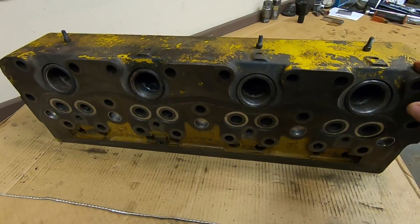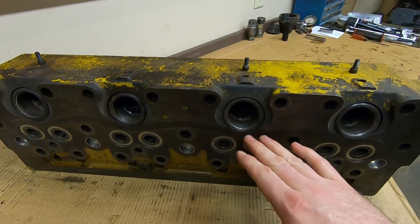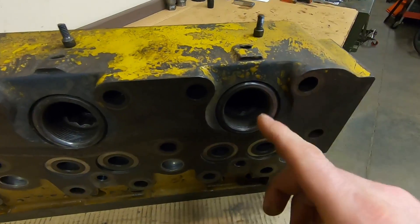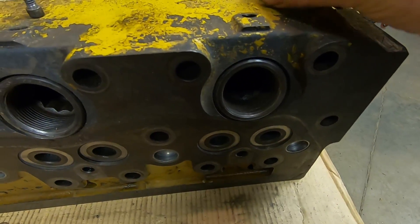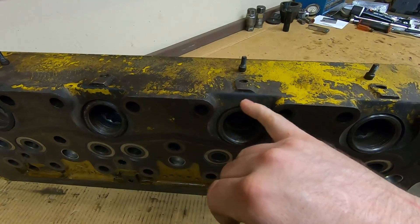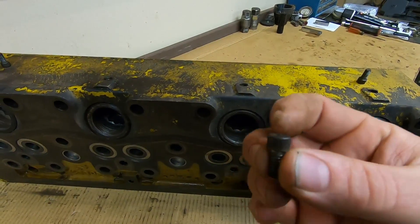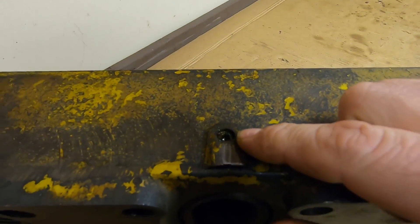That brings us to 2115's old head — the cylinder head casting I would really like to use for the 11-13 project. To pull these out — and there are several reasons why I may need to — each one has a little allen head set screw that goes in here as a backup means of retention for these chambers. The set screw runs down and puts pressure on the outer diameter of each chamber to lock it in. These set screws were eliminated in later tractors, and some heads actually came without any drillings for them. The manual even stated that if you didn't want to retain the set screws, you could cut them shorter so they wouldn't hit the chamber, but install them anyway just to seal that hole. I got the set screws out of one, two, and four — number three still has one stuck in for now, and that doesn't bother me.